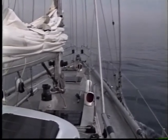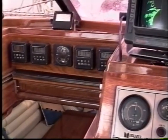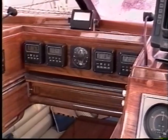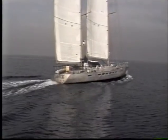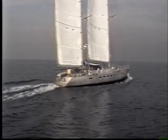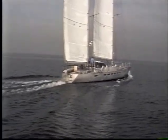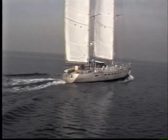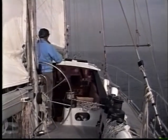At some point, you'll want to experiment to find out your range in different conditions. Sundeer will power for 2,000 miles at 10 knots in light airs. If there's a breeze to help us motor sail, range will jump by 30%. You've probably noticed Sundeer doesn't give much waterline length away to overhangs. That's a big advantage when she's powering as well as sailing. Cutting speed back to 8 knots increases range by another 25%.